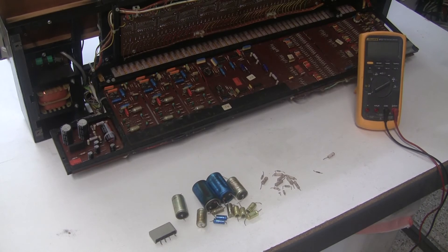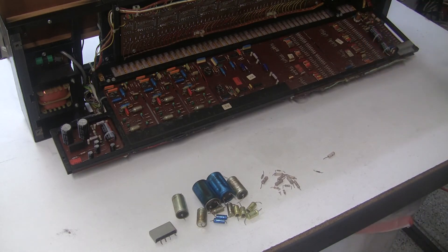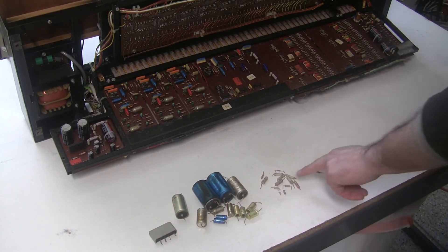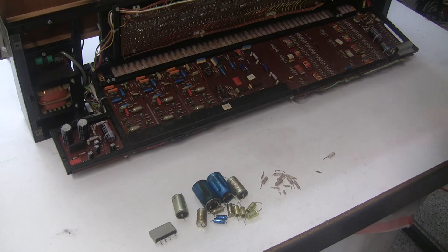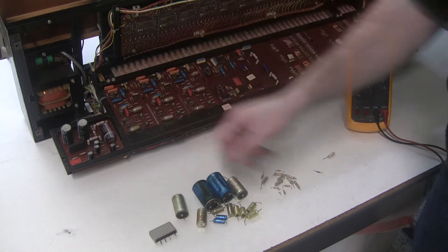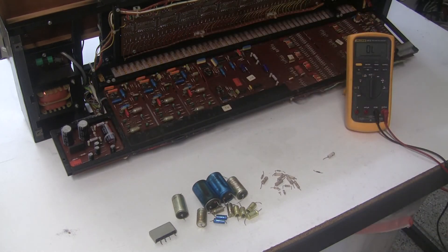The power rails are fairly close to what they should be, so nothing has catastrophically failed — but let's check the resistors and see if they changed value over time. Here is the power supply board with the old components removed; there's barely anything left — everything on there was underrated or dried up and needed replacing. The power supply is now rebuilt, with new components on this board, the master oscillator board, the gate board, and the baseboard on the back.